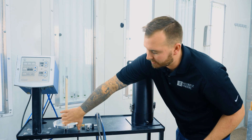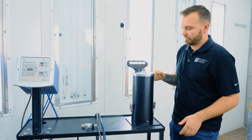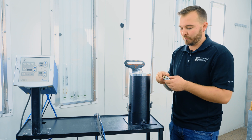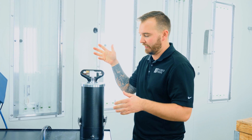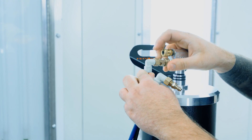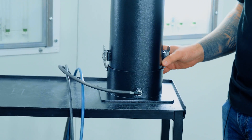The last main component is a nice billet machined piece with a pickup tube attached — this slides right in and fits right over top. And the last component with our hopper, which will vary depending on the gun you're using — we use Nordson Encore systems here — is a pump head that will slide right into the top of your top hat. Your pump head will then be ready for your air connections, your male-female fittings, as well as your fluidizing air pressure line, which fits right into the bottom of that fitting.